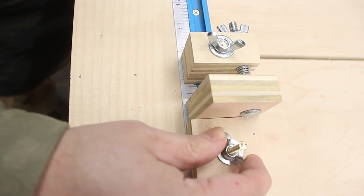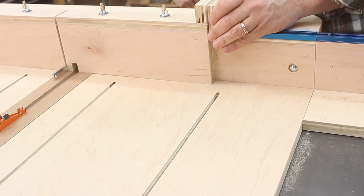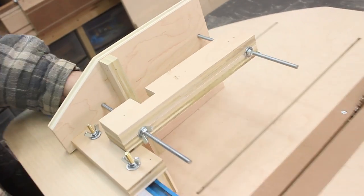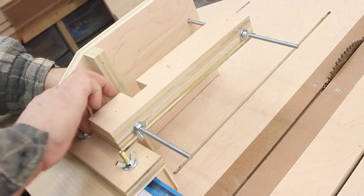When you get it where you want it, you lock the jig down and you go. It's great for fine-tuning everything. The first of the three major jigs is the Tenon Jig, and really it's much more than a tenon jig — it'll cut half laps, bridle joints, anything that requires a workpiece to stand up on it. Randy tried to cut an apple with it, set off the saw stop. Moron.